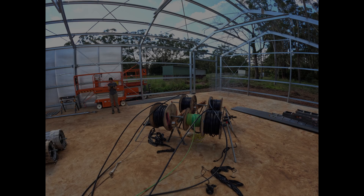Here's where things got a little bit hectic. How were we going to recover from this broken rope? We had an Easter long weekend, lots of gear on hire, and we really only had today to do it with everyone on site. A quick phone call and some thinking led us to buying a 16mm conduit from the local hardware store — substantially smaller than our 100mm — and we used that as a giant rod to push back down the conduit. We needed 125 metres of the stuff, but for the cost and time it was the best solution, and in two hours we were up and running again.